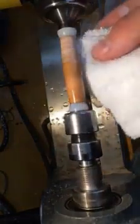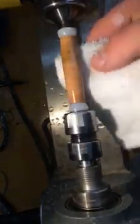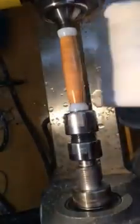So, a good dime size, nickel size amount. Apply it slow, let it run slow for a couple seconds. Go to a clean spot on it, constantly moving, and speed up the blank. You want to run this speed for, I don't know, 15 to 20 seconds, get a good buff. And bam, that will give you a nice mirror finish with no streaks in it.